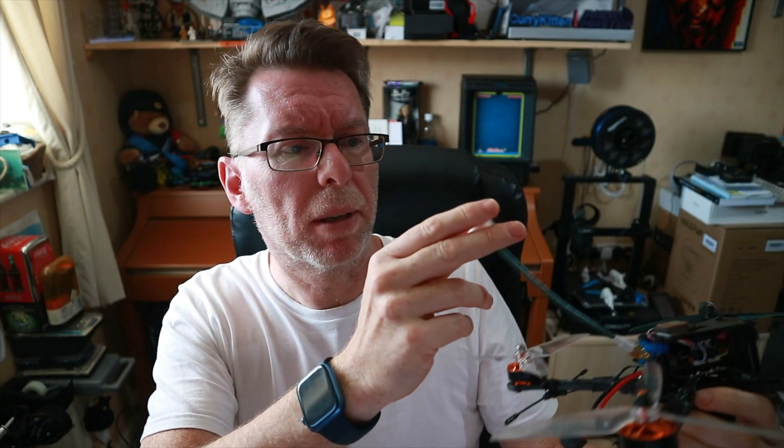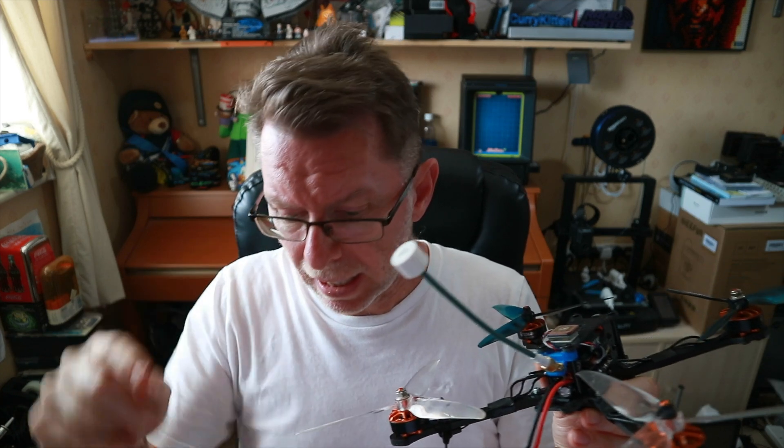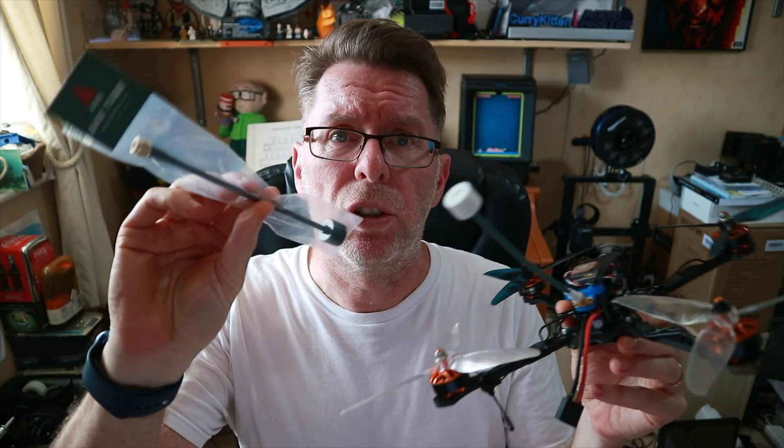One thing I didn't mention before is the antennas. These are the tube antennas by AKK — there are two of them. This one is the 5.8GHz version and works in the frequency range of 5500 to 6060 MHz. If you want to operate in the 4900 to 5500 MHz range, you'd want the 5GHz tube antenna, which is a different color. I should point out that just because somebody makes something that operates in these frequency ranges doesn't necessarily mean it's legal to do so in your area, so always double-check whether the frequency and power level are legal — because in many places they won't be.